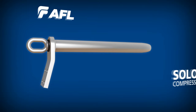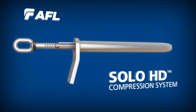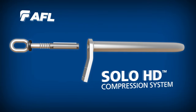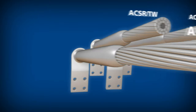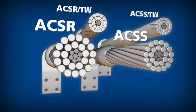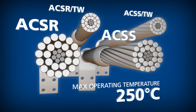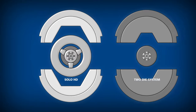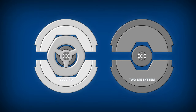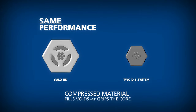AFL presents the Solo HD compression system, the perfect option to reduce installation costs and increase productivity. The Solo HD system is suitable for ACSR and ACSS conductor with a max operating temperature of 250 degrees Celsius. This single die, high temperature compression system offers the same reliable and proven performance provided by the current industry standard